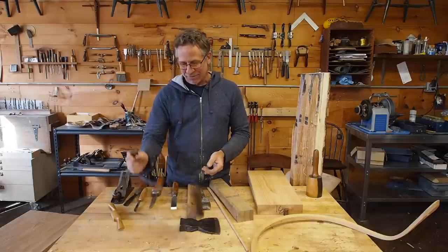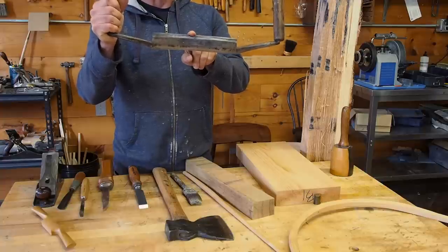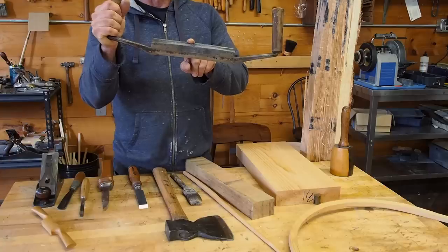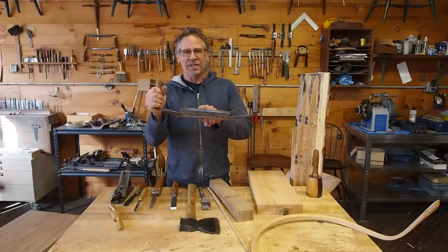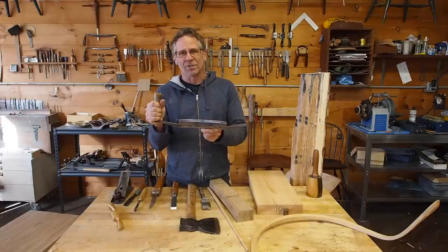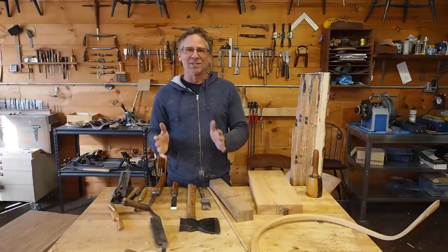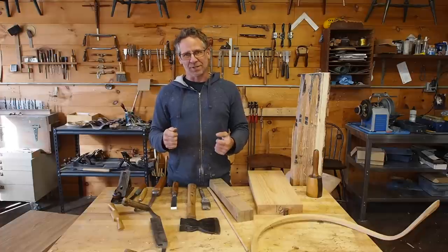And another way of making this more viscerally obvious is to put my finger on here. Now this is reasonably sharp, and I can press really hard, and it's not gonna cut me, because at the angle it's actually ground to, it can't do that. I mean, it probably could if I really pushed it super hard, but boy, if I slide that finger at all, it's gonna cut right into me, just like a tomato. And the reason that's gonna happen is because I, at that point, because I'm just going sideways across there, have lowered that cutting angle so terribly much, there's just no stopping it from cutting. And I use that all the time. Every tool that I pick up, I think, how can I skew and slice this tool to get the most out of it? Because hand tools don't work just because you're physically powerful.